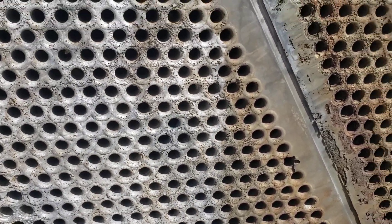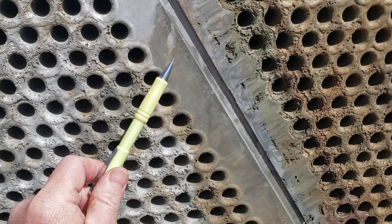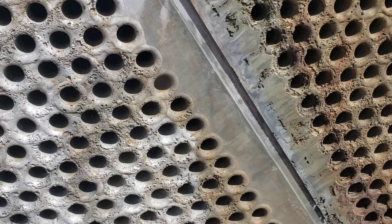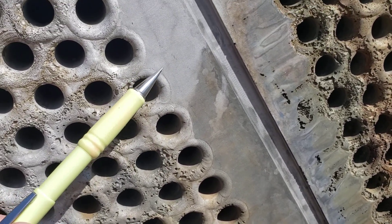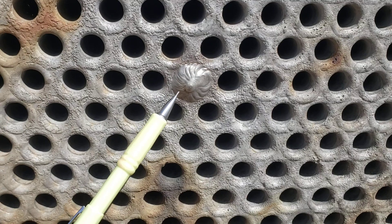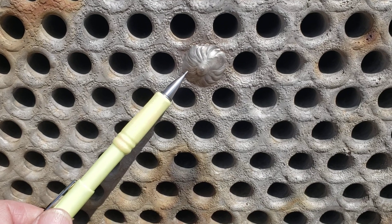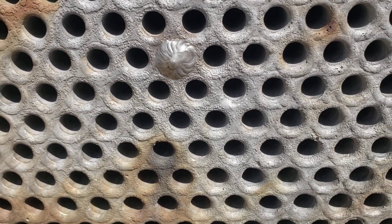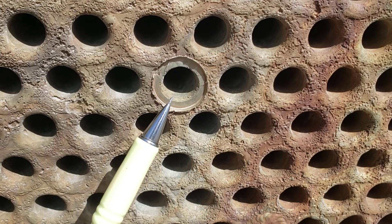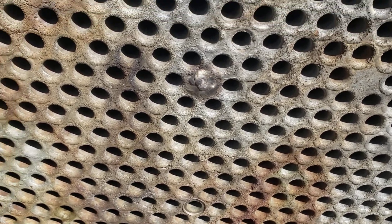It's obviously not worth rebuilding. You notice, though, that most of the weld metal buildup base material doesn't show a lot of corrosion. In some areas it's still showing the original machine marks. Where the stay rods have been welded, these are repaired areas where it was repaired several times. Here's another neat one where they tried putting in a plug — they definitely tried to extend the life of this bundle and were successful.